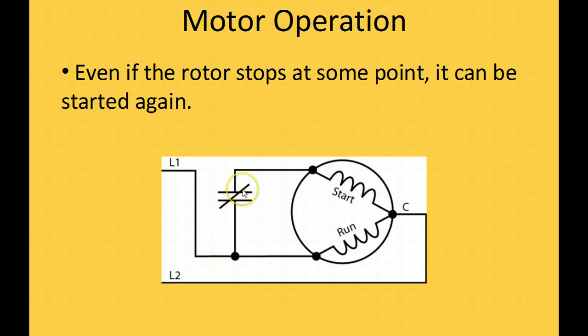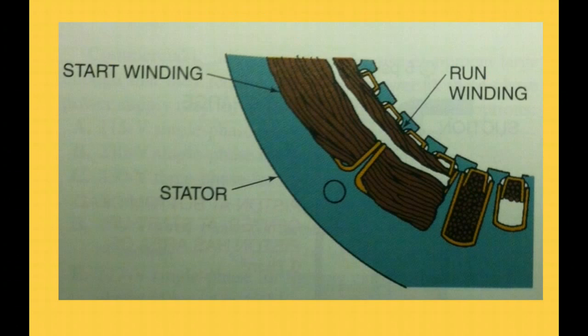This is a quick overview of what happens with a start and run winding. This diagram depicts — not exactly how they're wired, but it shows — that the run and start windings are slightly out of balance, causing just a little bit of a phase shift between them. It's a magnetic imbalance that gives the rotor just the push it needs to get going. In reality, the run winding is wound in very close proximity to the start windings, and they're designed to create a small shift of magnetic phase to get the rotor spinning. We'll get into all the different motor types and what you need to know for the NATE exam in the next videos.